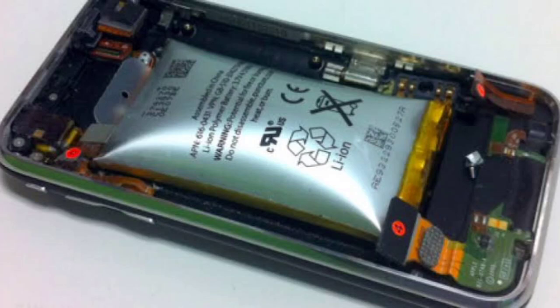If you continue to use that battery as it's expanded, one day the casing of the lithium-ion or lithium polymer battery — or the power bank — will not be able to hold it anymore. The first thing you usually see is the battery popping up the cover or casing of the power bank. That's step one. Step two, the battery is going to go boom eventually when there's enough pressure caused by the gases released inside.